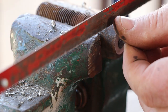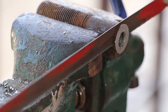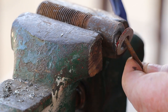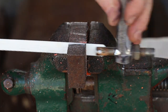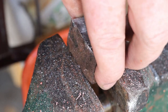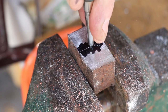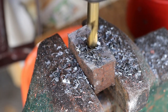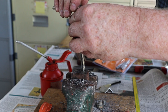That worked fine but I don't like the big diameter on this washer so we'll use this second piece of scrap to make a better washer. My hacksawing skills are probably best described as adequate, but I know a couple of old boys who could pick up a hacksaw and saw this whole bolt into a perfect stack of identical coins. I think that washer turned out okay so now we can start working on the wing nut. I've switched to a coarse blade in the hacksaw to cut the steel block for the wing nut. Once we've cut the block I'll mark and punch the centre.